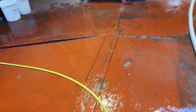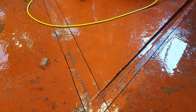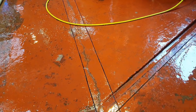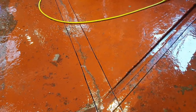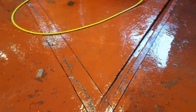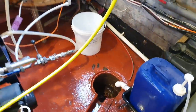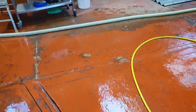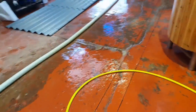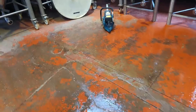But I think now is the time, as we're moving forwards, to perhaps cut that crack out. And instead of just doing a bodge and a repair and then epoxying over it, we'll put a proper drainage channel in there — a proper one that's serviceable. We'll link it up to the drainage soak away over here, and we'll have it all capped so there's no trip hazards, with some proper U-channel.